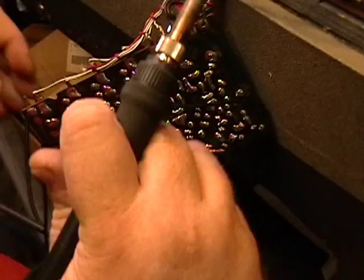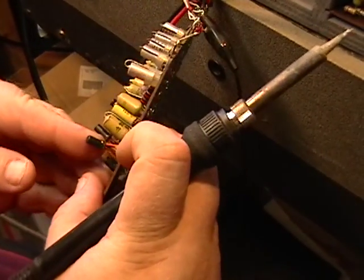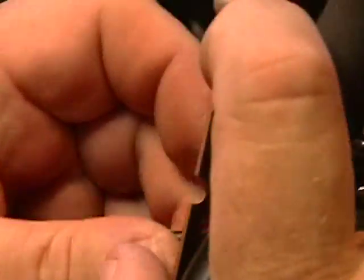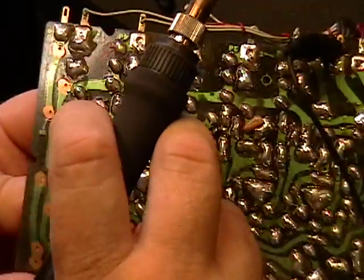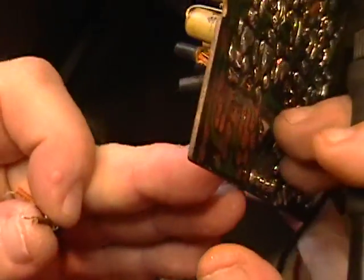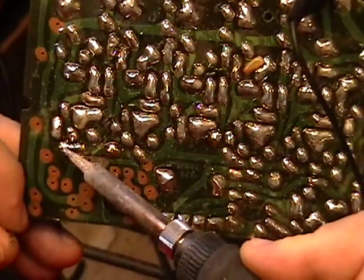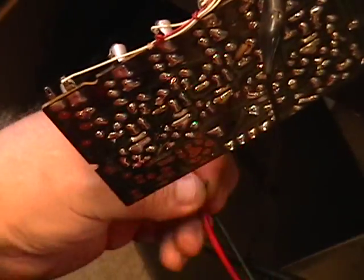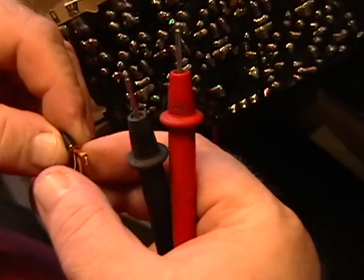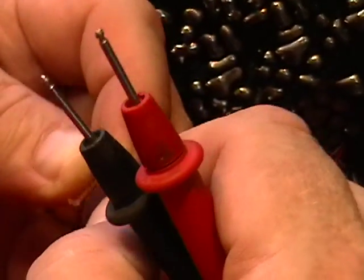But you're checking them in series. Well, what we did is we checked them as 2 separate diodes. And now I'm going to yank them because I don't get a reading that makes much sense except for one of them. That's the C lead. No question about that. That's the B lead. And that was the E lead. Okay. Let's see what we get now. If you have one of these and it's got a little dot on the case, that's the collector. Alrighty. So those are PNP.